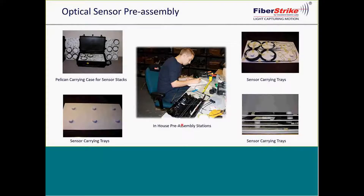After reviewing all the different types of sensors, one thing we do is in-house pre-assembly before we install on any bridge, whether new or existing. We arrange the fiber with the sensors already attached for various channels and package them for secure shipping so they can be placed in the field. This reduces a lot of field time for the pre-assembly work on our optical systems.